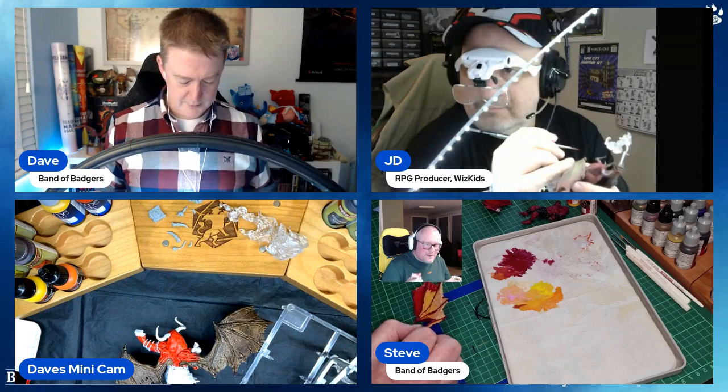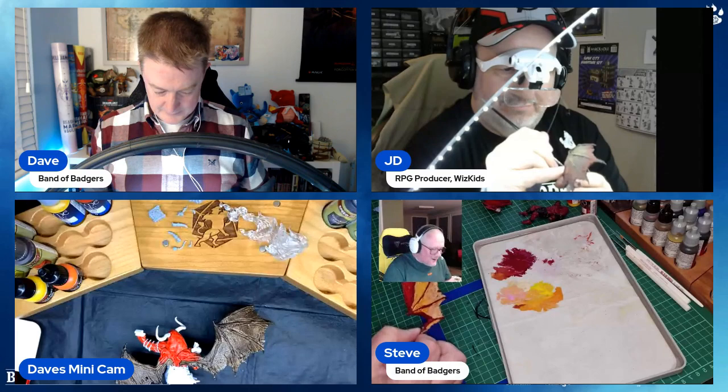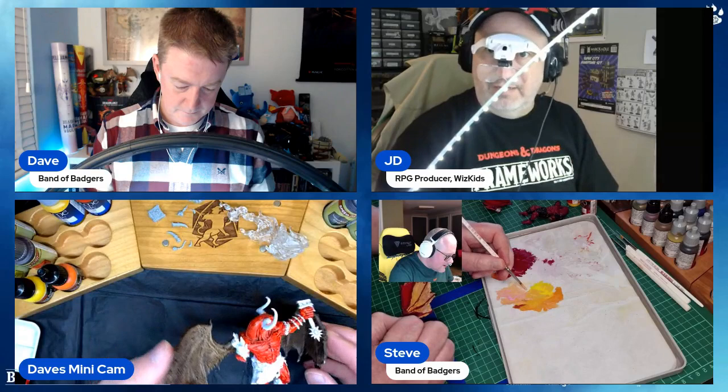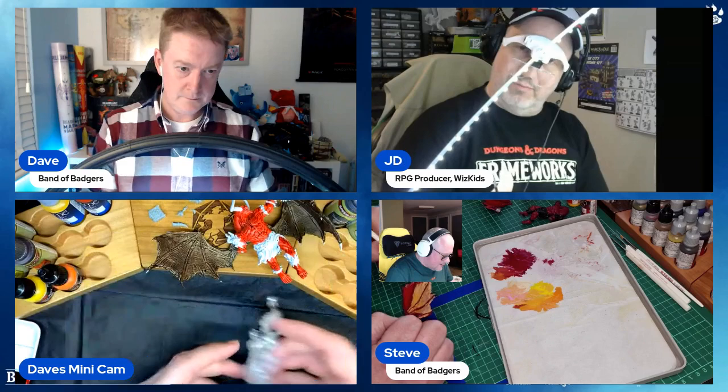So, interestingly enough, going back to the question that Big Tooth Pete asked earlier. Nice job saying that so very carefully. Yeah, that book came in three pieces. It had the two halves and the spine. So it's an interesting split. It was a good question from Pete earlier on how they actually design that when they're splitting the model up and then laying it out on the sprues. Yeah, the rule is basically that the more detail it has, especially in three dimensions, the more it needs to be separated into individual pieces. We could have done that book as simply an oblong box with a little bit of detail in the cover, and it would have sufficed, but it would have just been very plain, and it would have been just one piece. Getting it so that you can put it in the mold and then actually have the mold let it go when the mold opens, that's why it requires breaking it into different pieces.